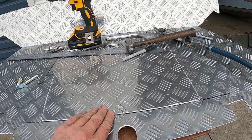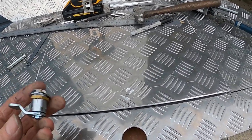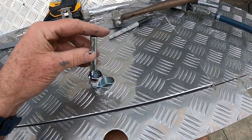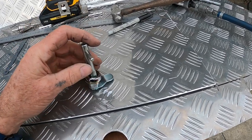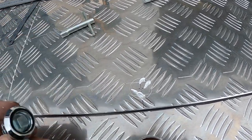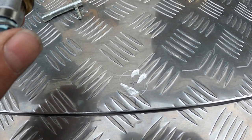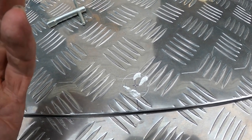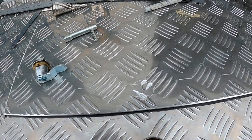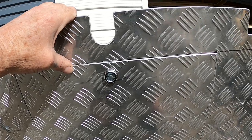I got my hinges fitted - that all works good. Now I've just got to fit the latch that I bought. Basically it has a little key which turns it. I've got to put this shape into this plate here which I've marked out. I'll drill a 16mm hole then file it out to the 19mm for the thread size - I'll use that to create the hole and then file it out. I've got my latch fitted and filed out - all looks good.